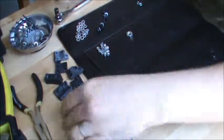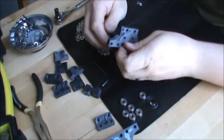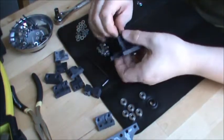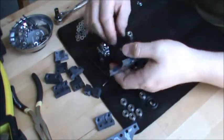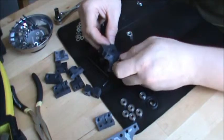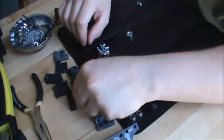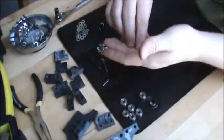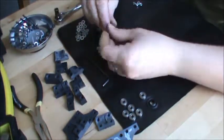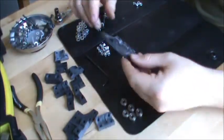Good morning. I'm going to try to build the vertical bearing 360. It's the one that mounts on the x-axis and it has two sets of three knuckle bearing type. It's supposed to replicate a linear bearing instead of bushings. This went away with the Prusa Mendel design — it was overall decided that it was kind of rough and hard to build. To me it is the hardest part of the entire build because there's so much going on.